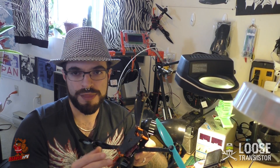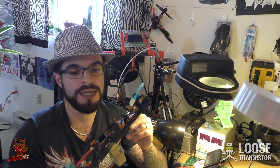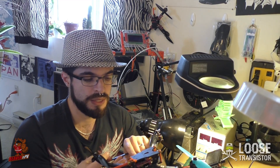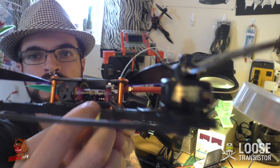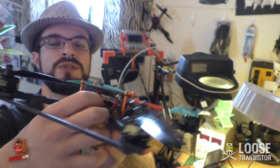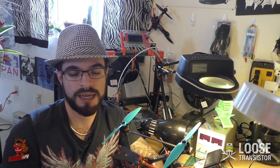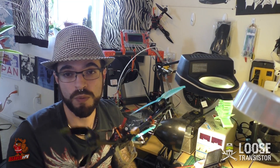I got the roll of death and went and talked to Ornery. I said hey, what can I do? This roll of death thing is not possible - I can't fly long range if I can't trust it, because any time I did a roll or flip the quad would just drop. He told me to just flip the Helio upside down. There's a little gray thing there - that's an inductor. That inductor is part of the 5-volt rail of the flight controller, which feeds the FC and the STM32 - the brains of the whole operation. What happens is when that inductor is really close to a 4-in-1 ESC, it can get electromagnetic interference from the ESC which causes voltage fluctuations, causing the FC to lock up. It's not necessarily a desync - it looks like a desync, but basically your FC just stops responding because the 5-volt rail is doing some funky stuff.